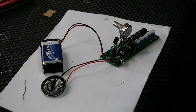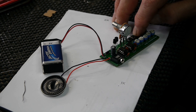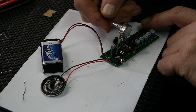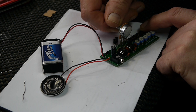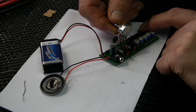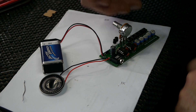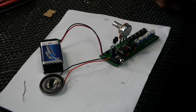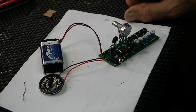This is how it works: you've got the five buttons along the front, and with the little potentiometers you can set the tones. Then with the big potentiometer that interacts between the two NE555 timers. You can actually play a tune on it, and it will sound a lot better if you take a jack out of it as well. It's a great little project.